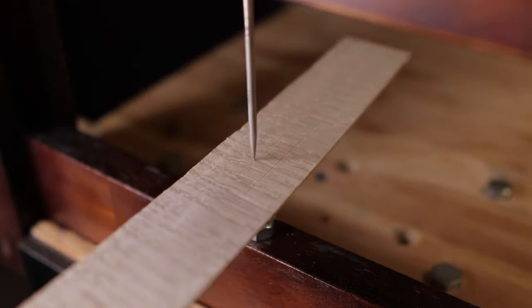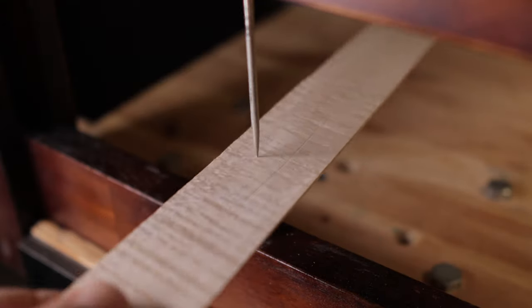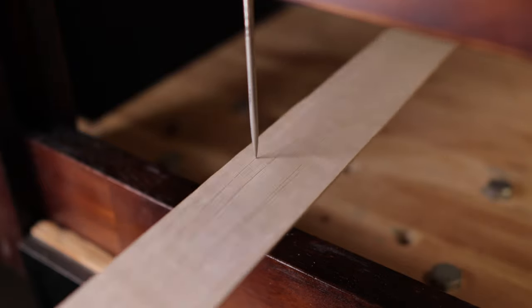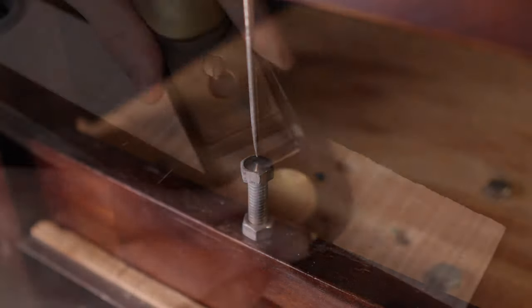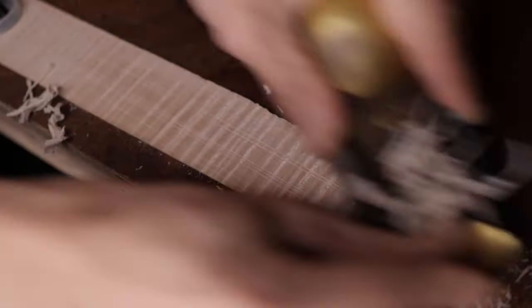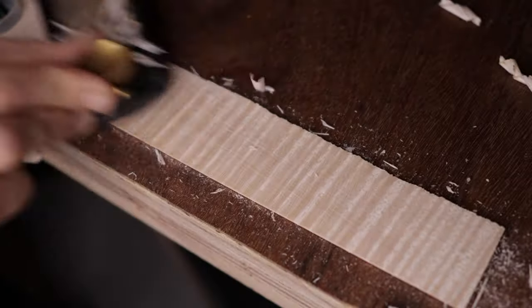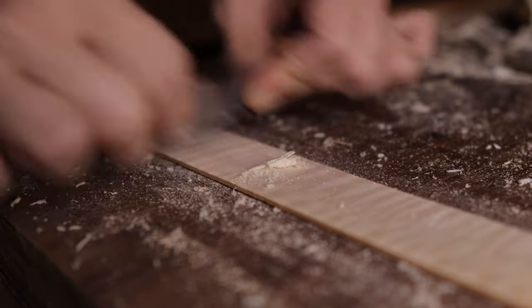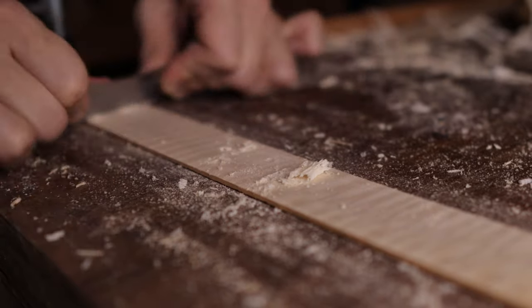The thing I'm using here is called a graduation chopper. The space between the needle and the screw is 1 millimeter, and everything that is thicker than that will get scratched. Simply plane off the scratch marks and you will have everything at 1 millimeter without using too much of your brain juice. Then scrape a little to make the surface smooth and shiny.